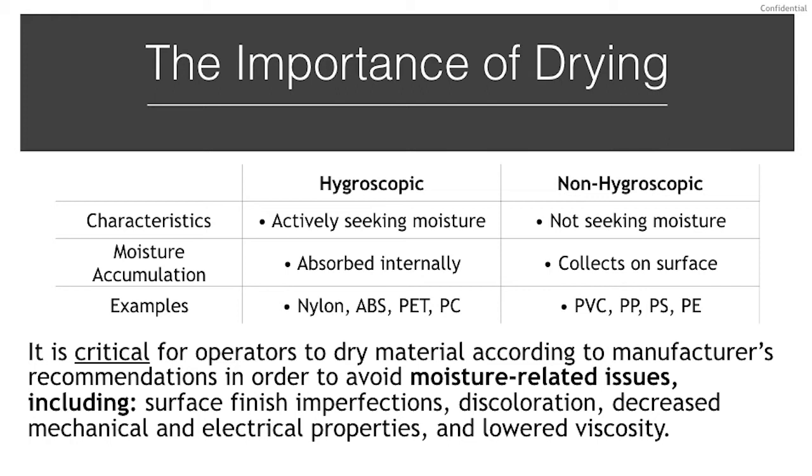The operator will need to pay attention to the spool and what type of material it's made out of. Each polymer will have a particular drying procedure, and you will want to make sure that the material used as the actual spool can take the temperature required to dry the spooled filament. For pellets, the manufacturer will supply various sizes of vacuum-sealed bags, and again, like the filament, it's up to the operator to dry the material before printing.